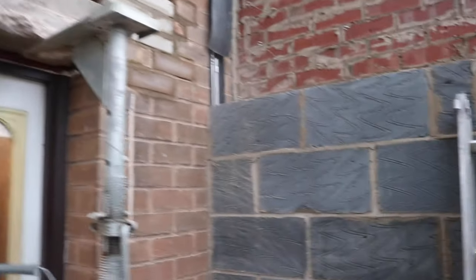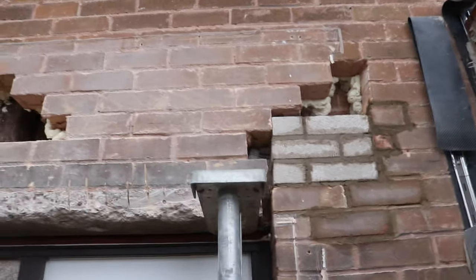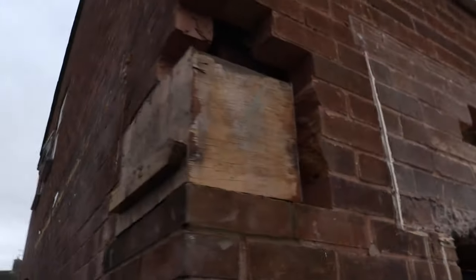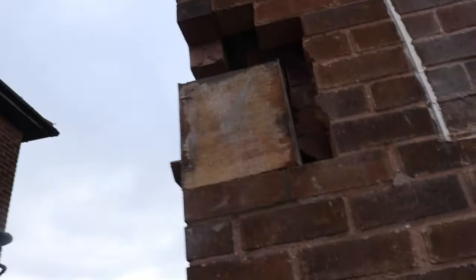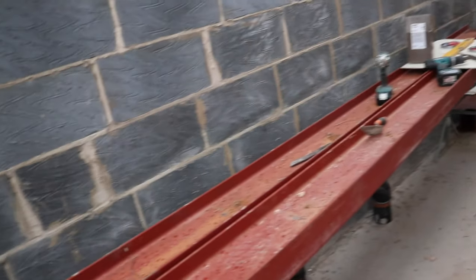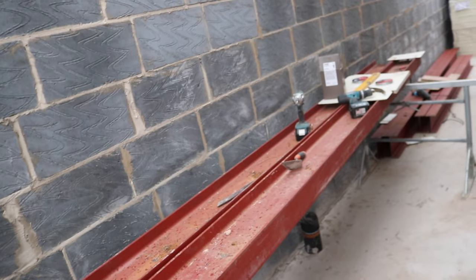The light's failing me now. We've got one padstone — a concrete cast-in-place padstone — built in place. I daren't take the shuttering off this casting tonight just in case it fails, so that's going to stay up there overnight. I'm going to have to foam the holes from the inside, because we can see into the building. I was hoping to get some steel in today but didn't get around to it — we'll do that tomorrow while we're waiting for the inspector.